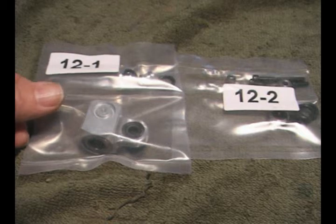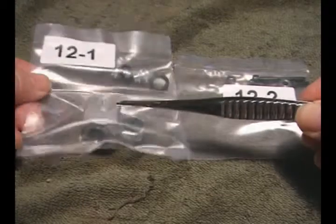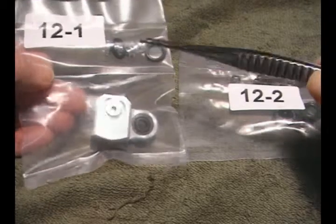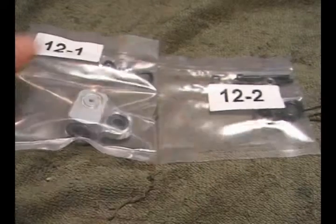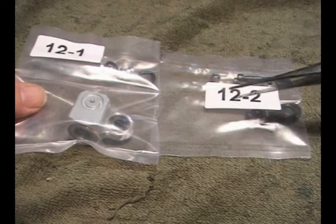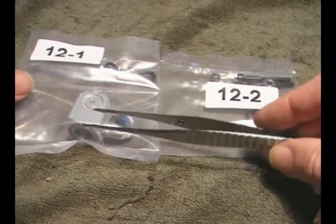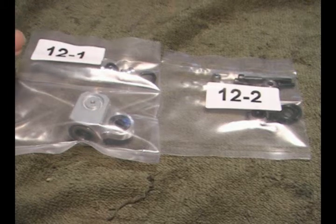Next up, we get to install our clutch bearing block, so we need bags 12, 1 and 2 for this. In bag 1 there's the nicely machined bearing block with a couple of bearings there for the starter shaft. It's rubber former mounted, basically to give some damping within the frames, and the novel feature of this is that we can actually preload the mounting with this damper here of the clutch block within the frame, so allow a little bit of movement when the frames twist, so they don't actually bind onto the starter shaft and actually slow down the motor. Another little novel Kasama design feature.